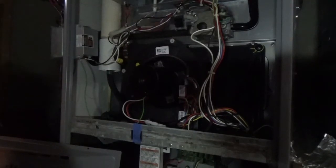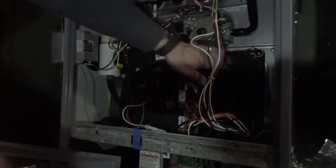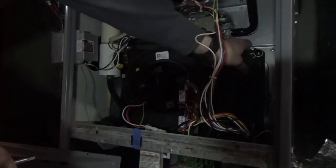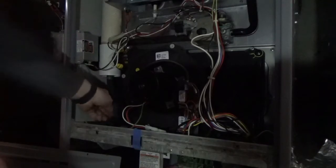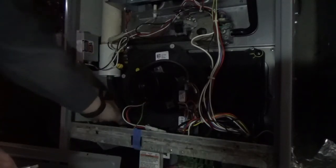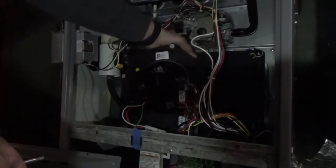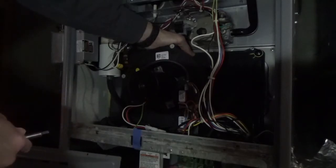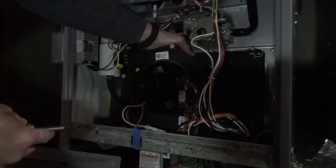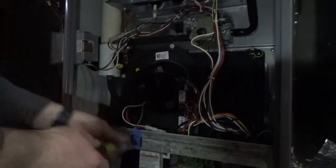After all that wonderful effort of getting everything back in place, I got on my computer and found out that this air box has vents at the bottom where the air goes in, and it does not look like it should have a crack there. I can feel it from the back — there's definitely a crack, definitely an air leak, and it's definitely going to be causing a problem for the vacuum. So I've got one on order. It cost fortunately only about $45.